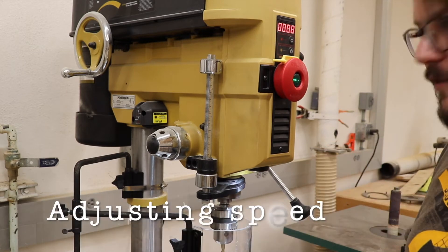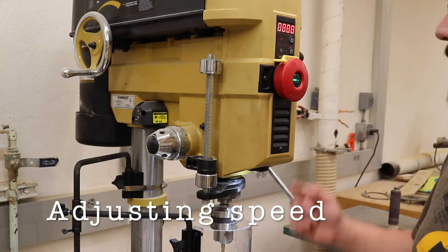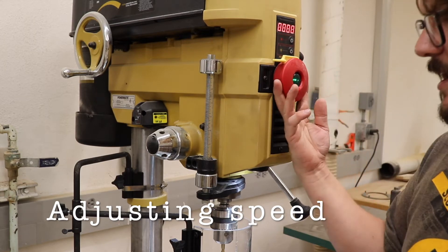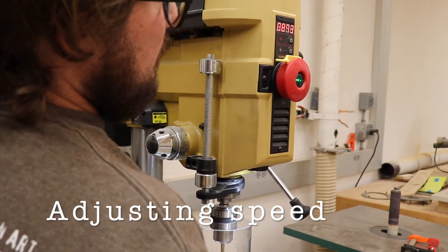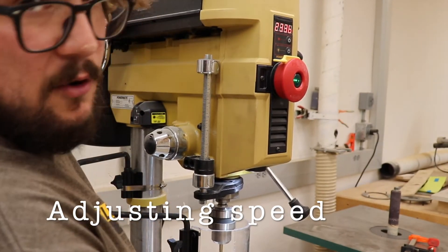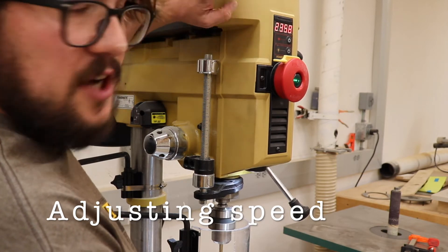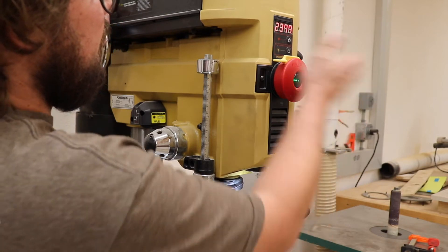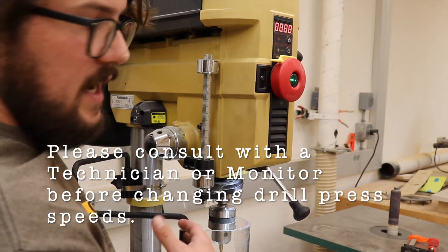If I look up here while the drill press is on, it will tell me how fast the drill bit is spinning. Some materials require high speeds, some require slow speeds, some require somewhere in the middle. I'm going to pull it on, crank this wheel back here, and you'll see the numbers change and hear the sound of the drill press change as I shift through the different settings — from very low to very high speed. The optical sensor takes a little while to catch up, and if it gets dirty, it will read all zeros; let us know and we'll clean it. Never change the speed of a drill press while it is stopped — it has to be running to change the speed in this fashion.